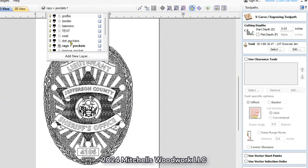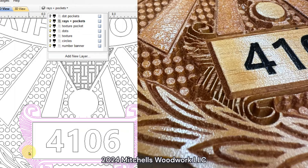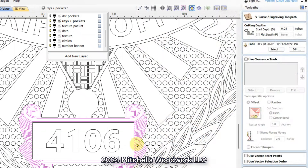Now we've got the number layer. I had never done one like this, so I just used the 30 degree V-bit on this. I didn't set a flat depth and I tried several different depths and just settled on that. It worked out fine. These were a little thin and there was a little bit of chipping in the real small areas there, but overall it turned out okay. If I had it to do over again, I probably would have set a flat depth just a little bit shallower to cut down on the chipping, but those were going to be very small fins regardless. I was happy with how that turned out, and those were started at 0.05.